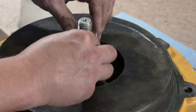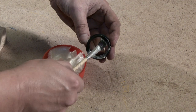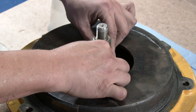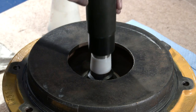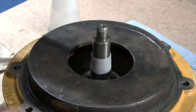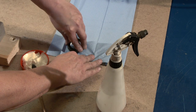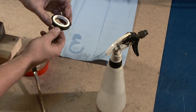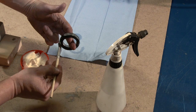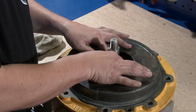Place the conical bush on the shaft to prevent the rubber bellows from being damaged during mounting. Lubricate the water deflector with soap or soapy water and push it onto the shaft. Push until it touches the cover and then a further one to one and a half millimeters. Unpack the mechanical seal and clean the sliding surface with alcohol. Be careful not to touch it after cleaning. Lubricate the outer rubber ring with soap or soapy water. Now press the seat into place and check that all parts are correctly embedded.